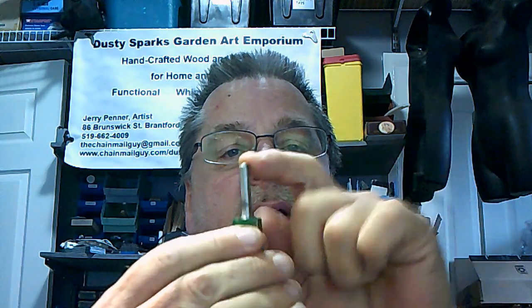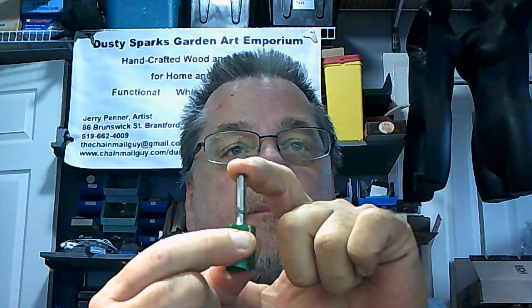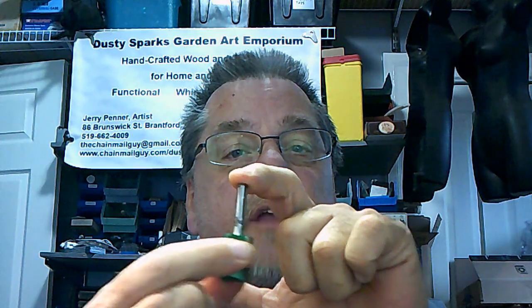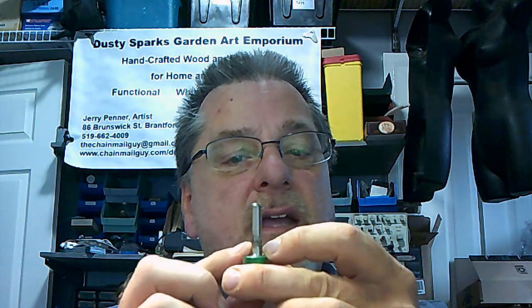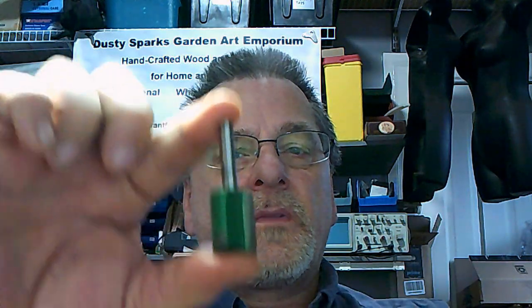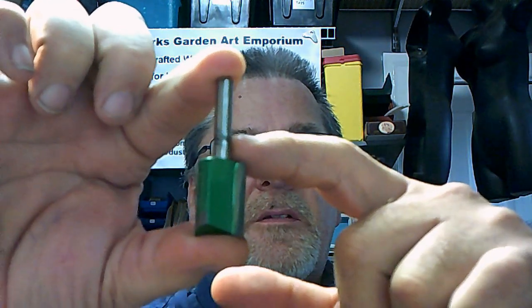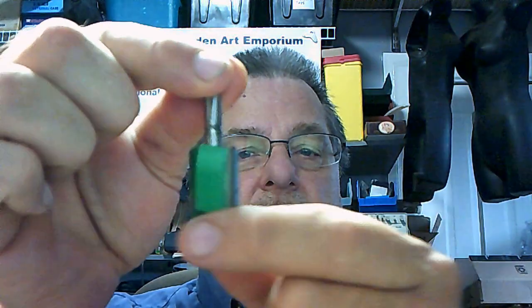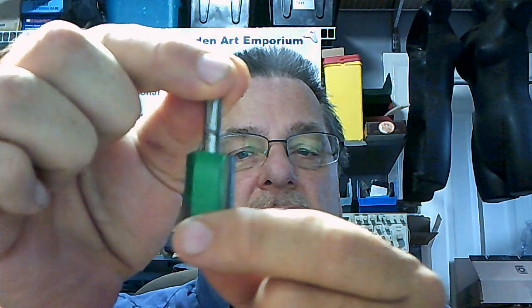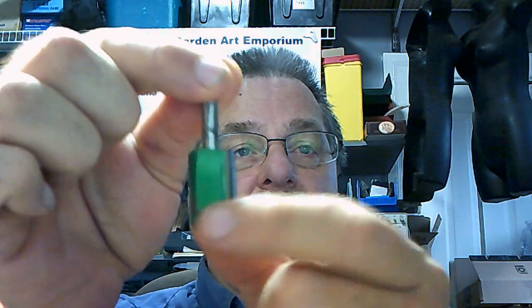That angry sound is actually the shaft wiggling inside the tool. It's actually wiggling inside the chuck. Even though the collet may be as tight as you can make it, this shaft is still wiggling and it's making that sound. You take a look here, you can see that damage. That is caused by the tool wiggling back and forth inside the chuck. That is what's making that sound.